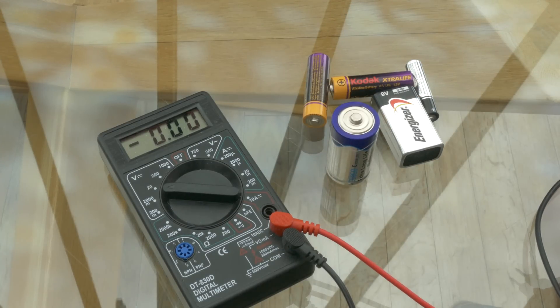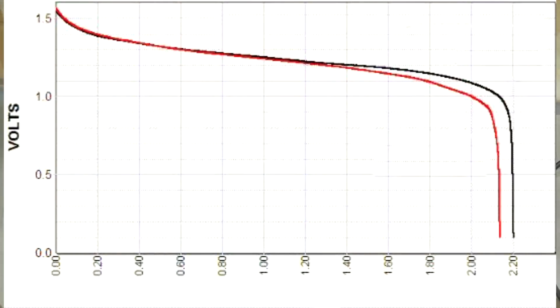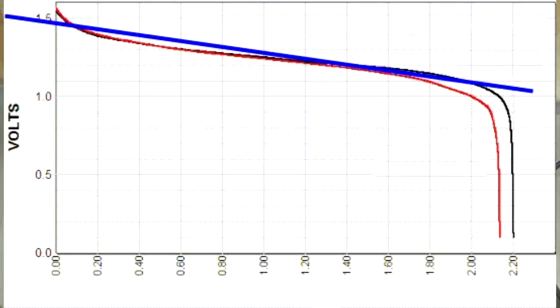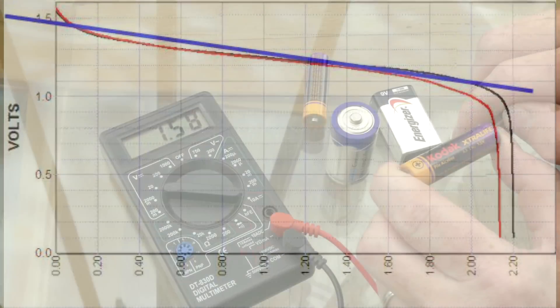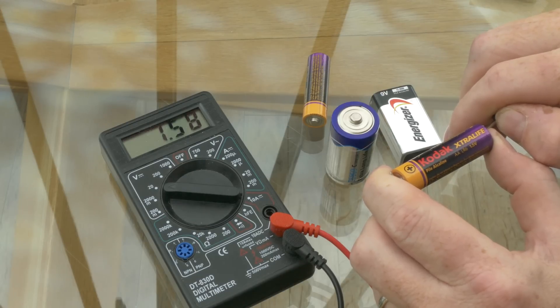The second thing to realize is that once the voltage drops to 1.1 volts as the cell discharges during use, the cell is considered dead. Now take a look at this picture — it shows voltage declining as the cell drains, but the interesting part is that the voltage drop is fairly constant over the usable voltage range. This makes life very simple since the useful range is just half a volt, with the lower range being 1.1. Just measure the voltage, subtract 1.1, and since it's a half-volt range, multiply by 200 to get the capacity as a percentage.